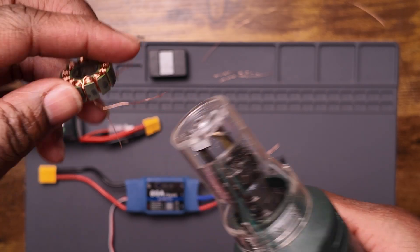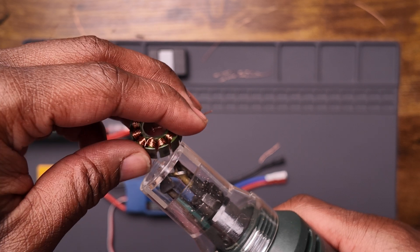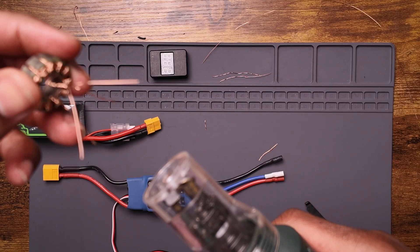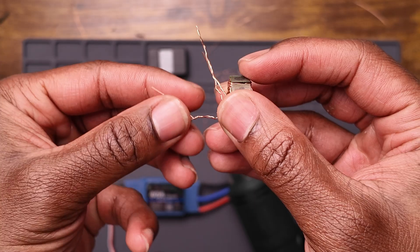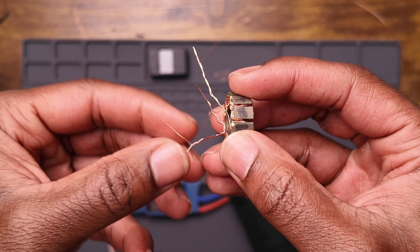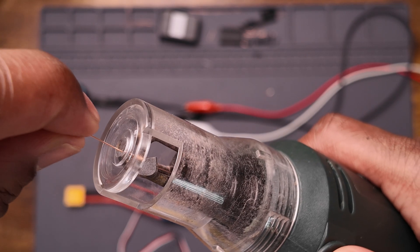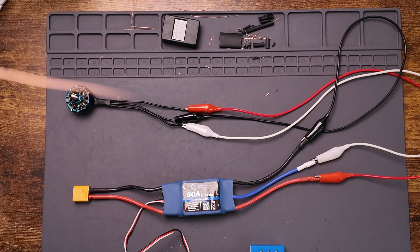The fastest way is to get a wire stripper, which runs about $70 from Amazon. You could also use a knife to scrape off the enamel, but personally with wire this thin I wouldn't recommend it. I went with the wire stripper because it's safer — especially with my daughter running around. I don't have to worry about disposing of acid, wearing protection, or it getting on my hands or face and turning me into Harvey Dent. The wire stripper is also really easy to use: put the end of the wire in, push down the button, pull the wire out — done in about five seconds.